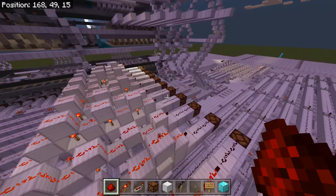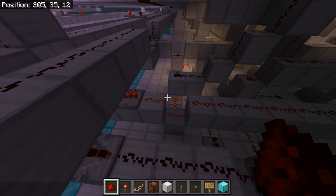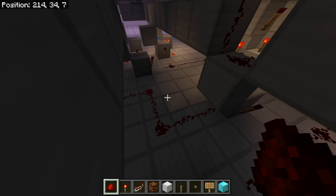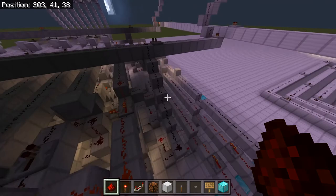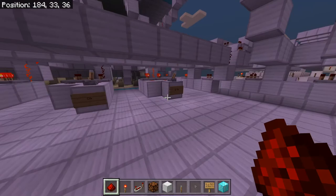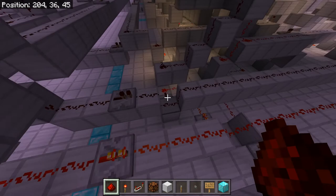You know, I can't remember. Can't remember whether our clear on the memory is a negative logic signal or not. And now I can't figure it out. The clear is disabled. One of our layers and columns and bytes should be enabled. Let's enable the write operation as well. And now for this one, which is byte 0, one of the clocks should be high and the other one should be low, but not what I'm seeing.